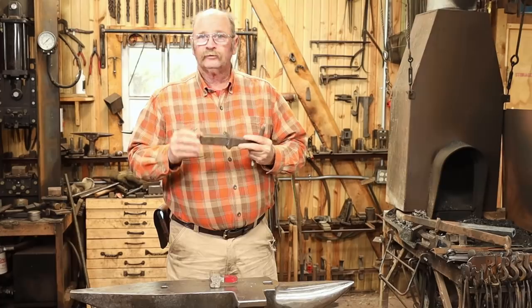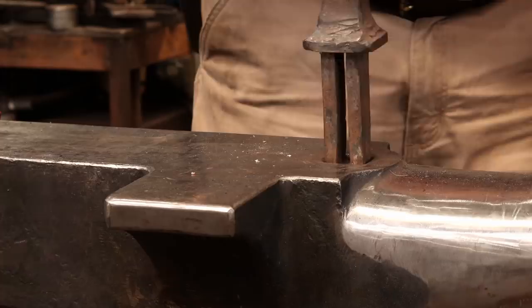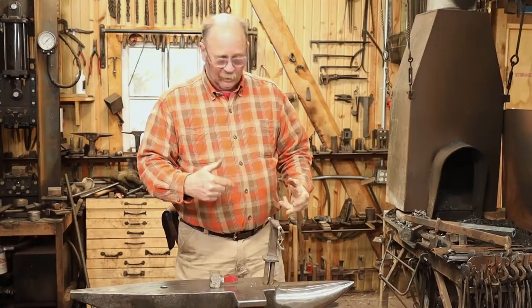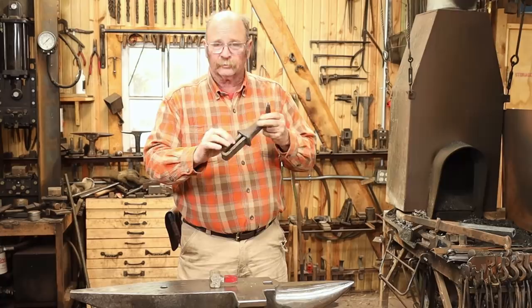When grinding these down, I get an idea how far the tool goes in by itself and then start grinding. If you see any rub marks on the side of the tool, that'll tell you something. Some of these tools just really need to be squared up first to make them a little more true. This one with a U-shaped shank designed to have a wedge driven through it is just irregular enough that it doesn't hardly drop into this anvil at all. So I'm going to grind it square and reduce that tail end without reducing the top. When it's all done, I want the very top to fit as tight as possible — if the tail end is tapered a little bit, that doesn't hurt anything.